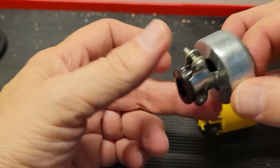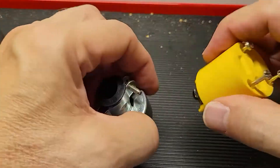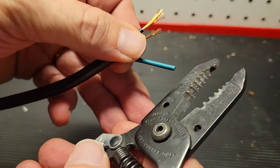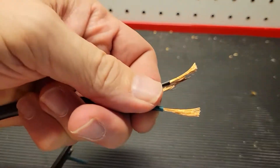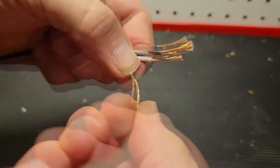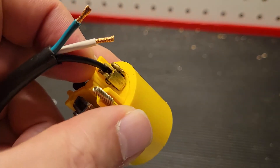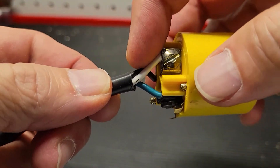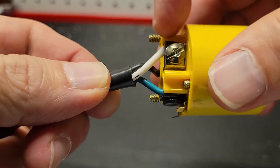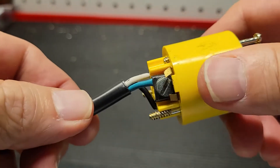Make sure to thread the wire through here first before you attach it, otherwise you'll have problems. Using a wire stripper, this is 14 gauge wire — I strip back about an inch of insulation and then twist the wires so I can put them on the screws. Correction: with this particular plug, the wire does not wrap around the screw head — it instead gets clamped in behind it. With everything tightened down, you should have insulation right up to the point of attachment and then the bare wire inside. Screw it all the way down, make sure it's tight, and check all of them.